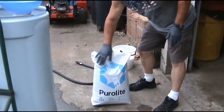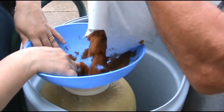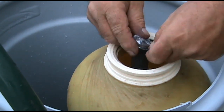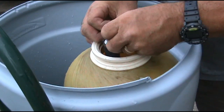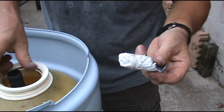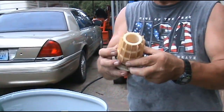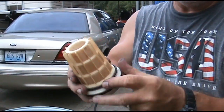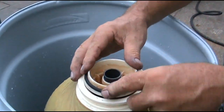You might want to get somebody to hold the funnel in the center while you pour your resin in because you don't want it to move. You already saw what came out of the tank — this whole bag has got to go back in. It's pretty heavy so you might want someone to help steady it. Go ahead and rinse the funnel with water, then remove your tape off the top of the tube. I put paper towel in mine just to be safe so nothing gets down in there. Here's our little filter — I'm going to put the O-ring on it and slide it down into the groove.